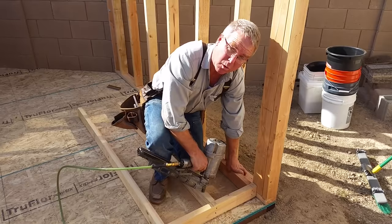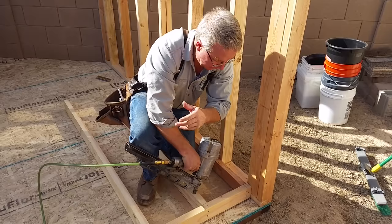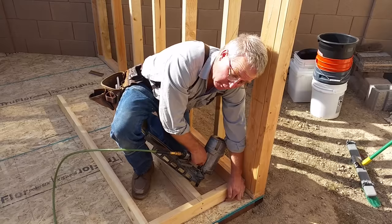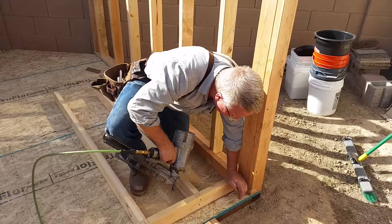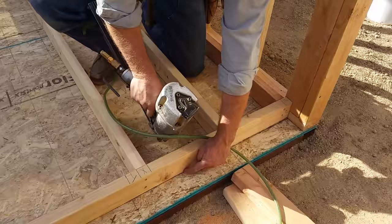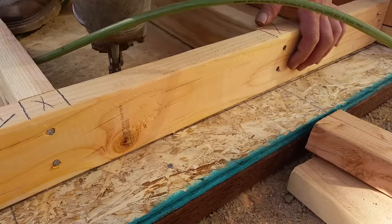This is a little example of standing a wall up on a wood floor system. I've got to keep those studs in the right spot for putting the top plate on and keep them in the right spot as I raise the wall up. You can put a toenail through — establish the mark for the inside of your bottom plate line and run a toenail through about like that. That nail is just penetrating at the wall line. When we raise this wall up, it'll bend that nail over, but the wall will come to rest about where it ought to be. Then you tune it up before you nail it down. It'll keep the wall from sliding as it's raised.